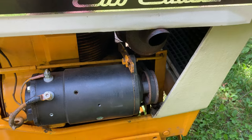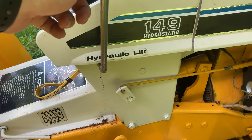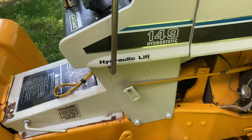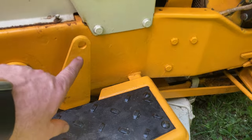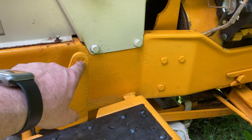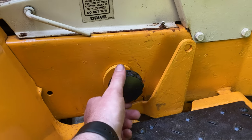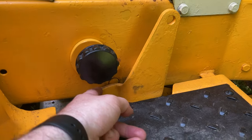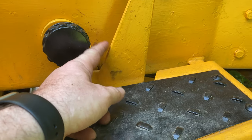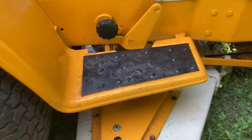You can see this is where the exhaust comes out. This tractor does have hydraulic lift for the deck and any other implements — it lifts the rear lift, the deck, and also the front. So if you have a snowplow on the front, there's a bar that goes up to the front and raises the snowplow. This is the adjustment for the deck height — you loosen this up and rotate it, and it determines how much height as this goes down. You can see how that rests against there, and that's what sets your mower deck height.